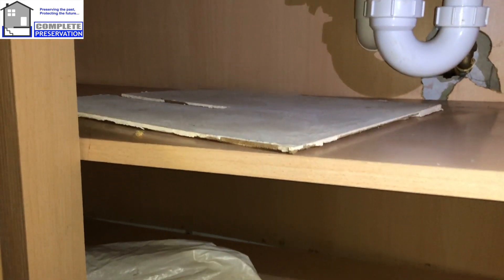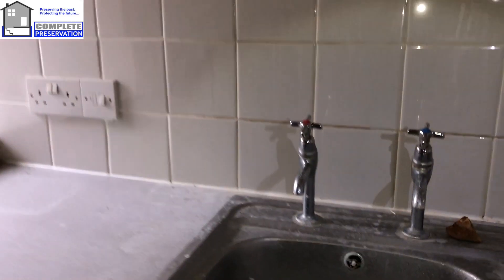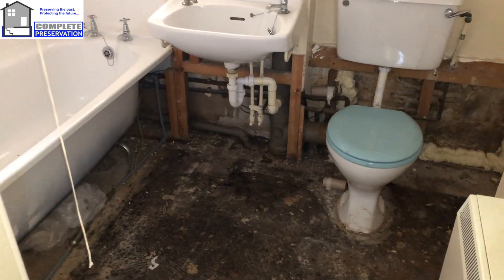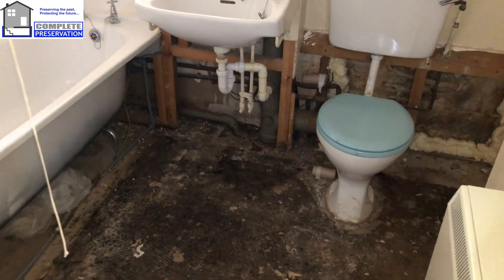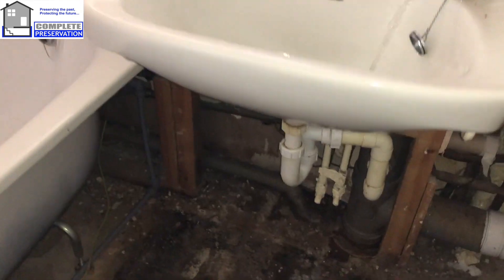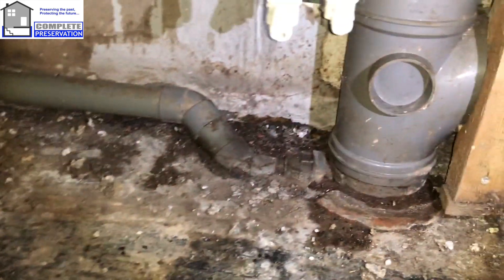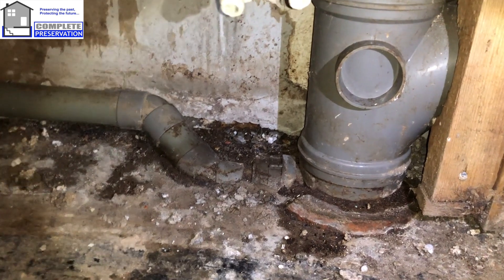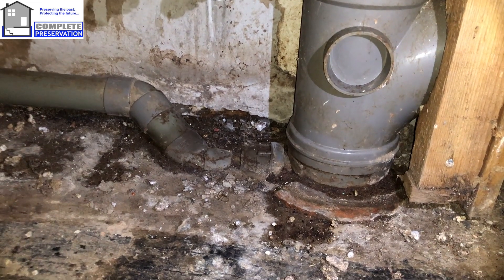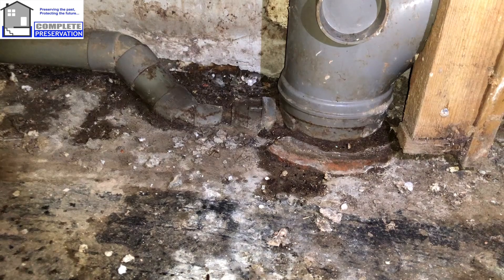Because I've had it before where I've been in there and I've caused a little bit of water - embarrassingly enough - to escape. So this has all been running for a long time. Now these leaks here were not visible when the taps were running for a few minutes. I've got this to leak over probably about 10-15 minutes. The stack basically had just a little bit of damp staining around there. I wasn't too sure if this was condensation occurring in the early hours of the morning, so what I've done was put a little pencil mark in.